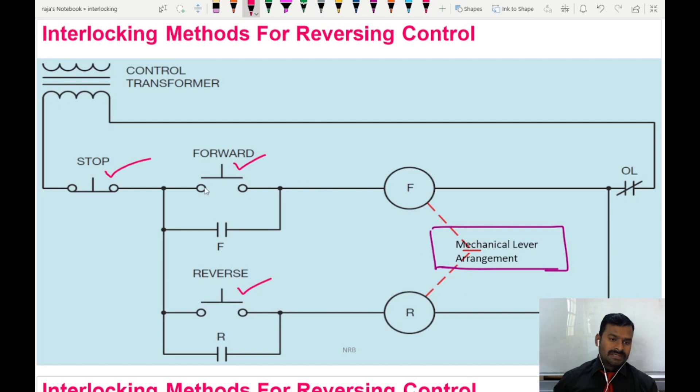When I press the forward push button, the circuit gets closed and the forward contactor energizes. The respective contacts close, so T1, T2, T3 are connected to L1, L2, L3 and the motor runs in the forward direction. Now if I want to change the direction of rotation, I should make sure the motor is stopped and then press the reverse push button so the motor runs in reverse. The reverse contactor ensures the forward contact is not going to get connected until the reverse coil is de-energized.